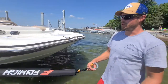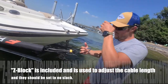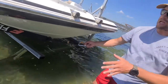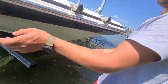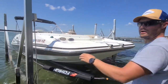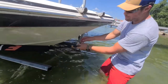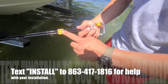With the boom assembled and laying across the boat in the position we want to ski, the next thing is adjusting your cables. These cables come adjusted quite long — for our boat we actually ended up taking out probably about four and a half feet. We found it worked best to pin this onto the boat and have someone hang and pull forward. If you look at the red handle or red mark there, we had someone hang and pull forward while out on the water — that gave us the proper amount of slack. We pulled the cables through to a good spot and then set and locked all eight set screws. It is very important that these are super tight.